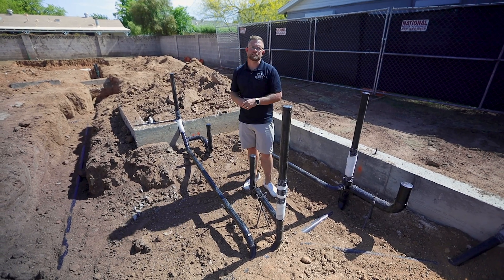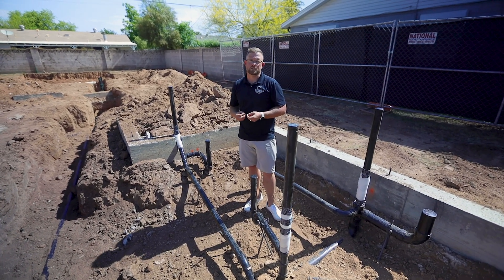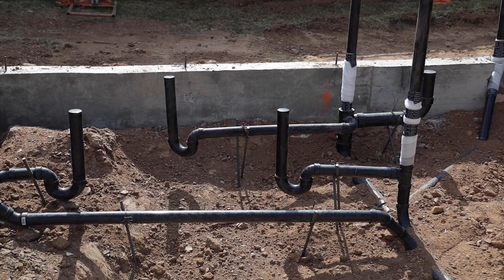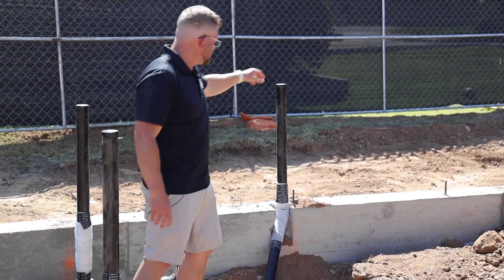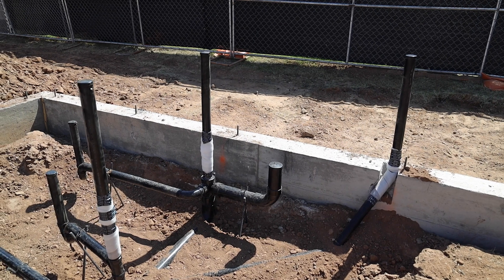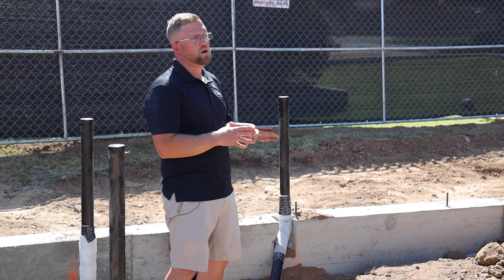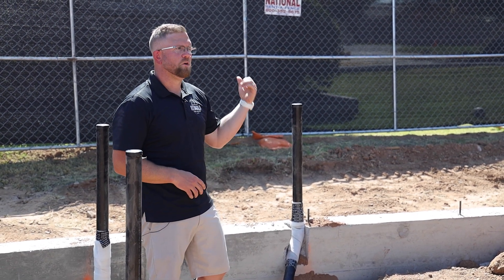To a lot of people this might just look like randomly placed black ABS, but there are a lot of nuances required during this stage of construction. All the exterior wrapped pipe is for our vent stacks and allows us to pour concrete appropriately while still having a little play to deal with any adjustments after completion. It also protects our pipe during the concrete pour to ensure no cracks take place and allows expansion and contraction around that pipe, ensuring all off-gassing within the sewer system is vented outside the home envelope through a roof penetration or wall penetration.